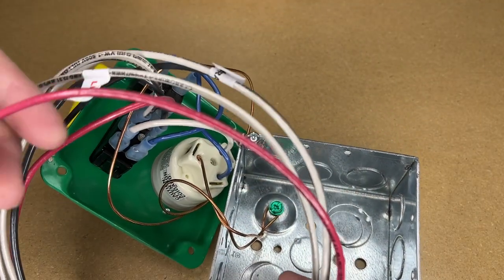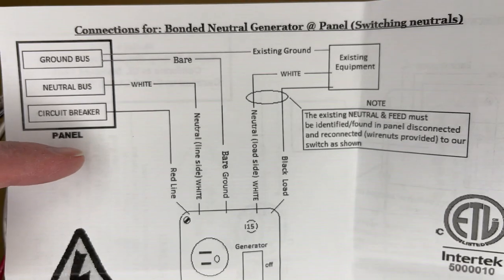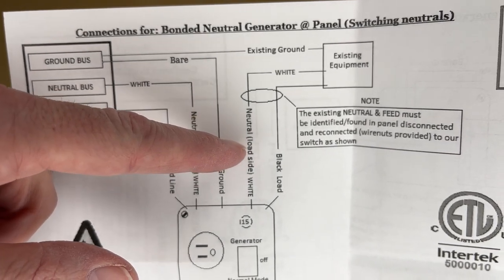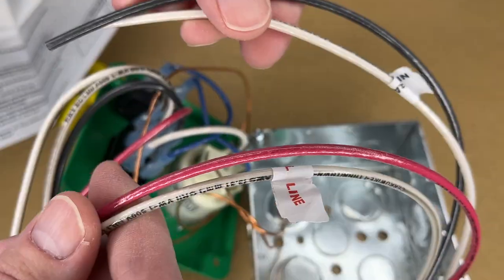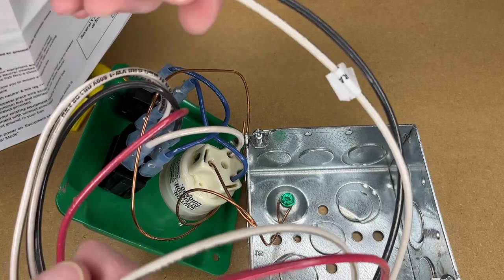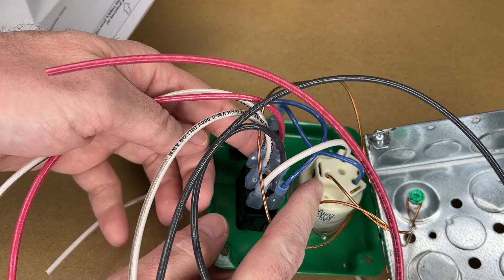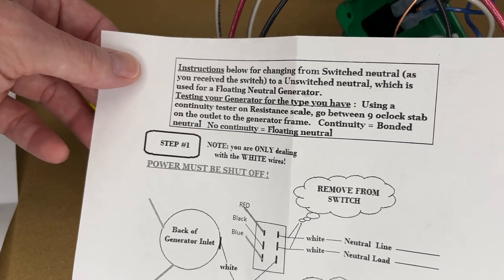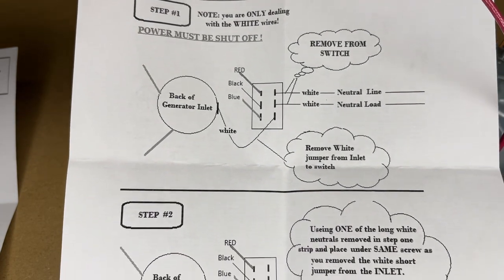The wires are labeled and this is pretty simple to install. Here's a diagram on how to hook this up. Your breaker panel is going to connect to the red and the neutral line side, and your load is going to connect to the neutral load side and black. So the red and the line neutral connect to your power, the black and the load neutral connect to your appliance, and the ground will all be bonded together. The line is on the outside of the switch, the generator outlet is on the opposite side, and the load is in the middle of the switch.